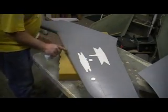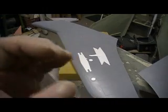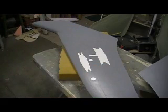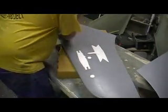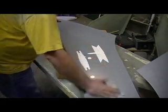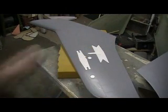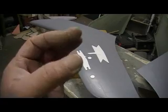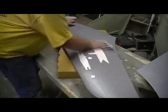The only thing I really didn't like is I had a few air bubbles in that leading edge. I think it was caused by that peel ply, cause it's actually stiffer than the cloth and it just don't like to go on them round edges. When you put a vacuum under it — bam — done deal. I think the super heavy peel ply is what pulled it off that edge. Cause I was watching when we was laying them up, and I trimmed it super close and it was in there, all good. Then we put that peel ply on there and the fiberglass stuck to the peel ply and it kind of came away from the primer a little bit in some places.